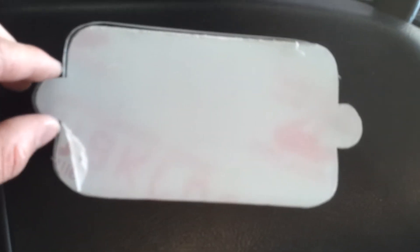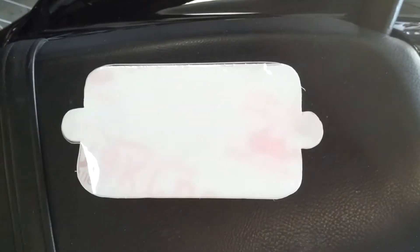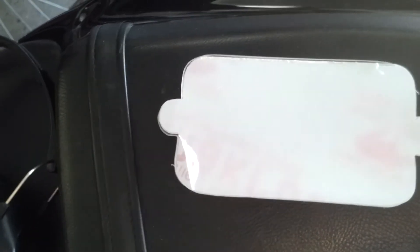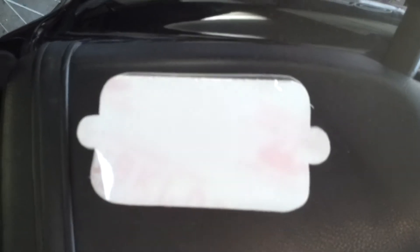So this will be a case. On one side I'll do a bolt that goes through it, tightened permanently with thread lock. On the other side there'll be a notch cut out, and then a stud inserted in the back which I'll actually end up melting into the polycarbonate. This will just slide open so you can slip your phone in, then slide closed. There'll be some padding — I'll probably use weather stripping from Home Depot — and I'll cut out a centerpiece so you can use the screen.